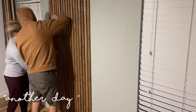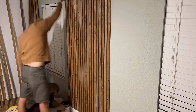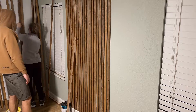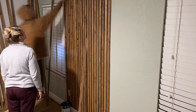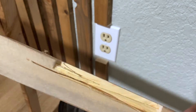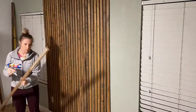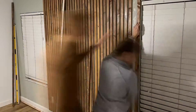We ran out of liquid nails, which we were using to put on the back of the boards before nailing them to the wall, so yet again this project is stalled for another day. Boards will acclimate once they are in the type of environment they're going to be in long term. We did have these boards in the garage for some time before applying the stain and the poly coat, so these boards did adjust throughout that time. The boards that are twisting are the hardest ones to get on the wall. We found that boards with more of an S curve are actually easier to apply — the nails are really good about keeping them from going side to side. But since we are using a brad nail from the nail gun, it's not the best nail for keeping the wood against the wall should it be bowing out from the middle. Just food for thought if you are taking this project on yourself.